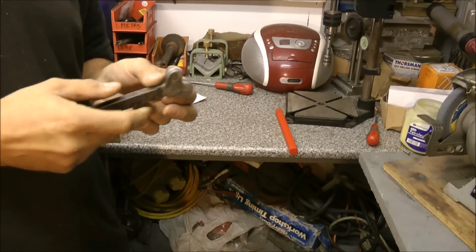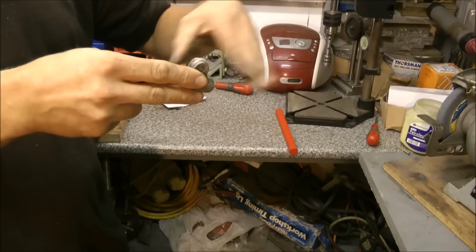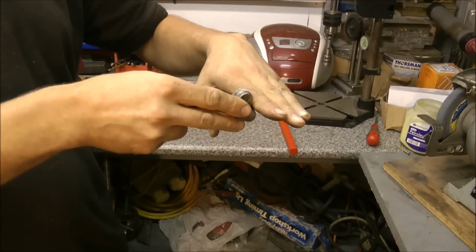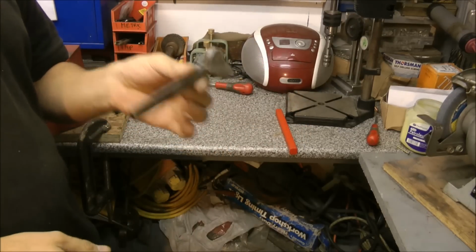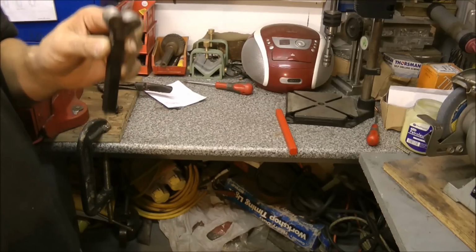These are absolutely bobbins. I've read up on them, and when you use these against the rotating workpiece, they can force the head bearings to wear on your lathe. And that's never a good thing, especially when you've got an old crusty lathe to start with. So, I need to make one of the clamping types. So, that is absolutely no use whatsoever. But you know me, I don't like doing things by halves.